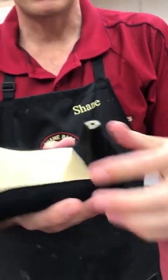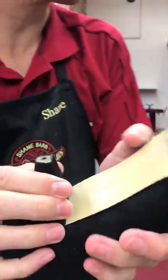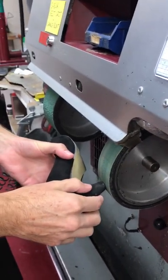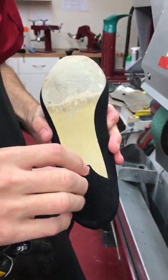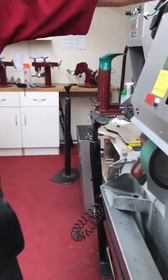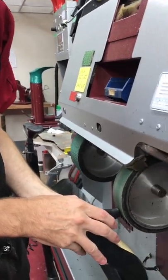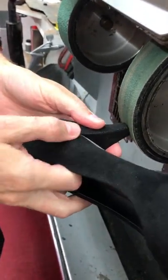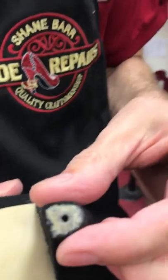It's hard to see now that the fabric's there, but the pin's a little bit longer than that corner — it's a little bit rounded. This was the good one. So what I'm going to do while grinding is make a real flat, nice crisp edge on here and pull it back this way. In the middle I'll just take a little bit longer because the pin's there and it takes longer to grind away, then just a fraction on the other side. Then I'm going to square the back up, square the side up, square the other side up, and grind from the back because there's a steel pin in the middle — spring steel, hard-wearing stuff.